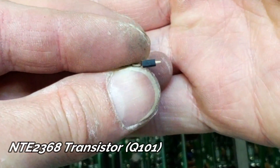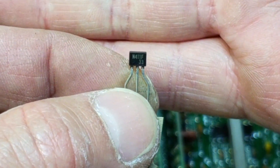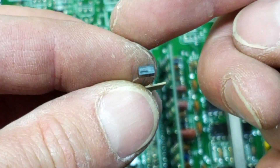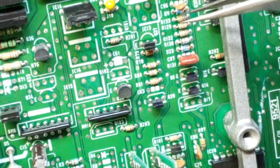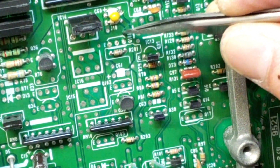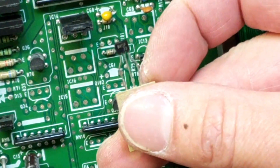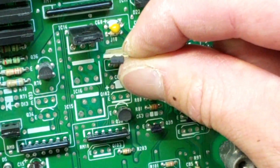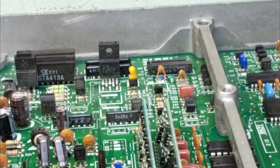The next thing is a jumper that goes on J10, which is right below that. After that we have a transistor on Q101. You can see the writing on the bottom side — normally it should be beveled, and as you can see on the board drawing it is beveled right there for the polarity. Since that's the bottom side, we're going to put it down like this. This is the last thing on the VTEC side — we are pretty much done there.